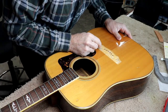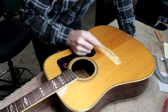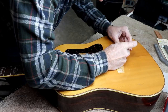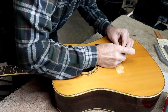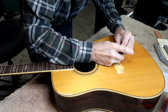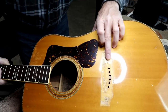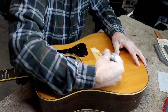We're going to have our work cut out for us on this one. That plywood is wanting to peel really badly, so it's going to be very difficult to get the glue off without taking the plywood off. I think there's a little bit of glue and it's mostly finish. My normal method of peeling it is going to grab all of this plywood veneer — it just wants to peel off really easy. It seems if I go across the grain instead of with it, it's not peeling as bad. So I'm going at a 45 to the grain rather than one way or the other. That's working pretty well.